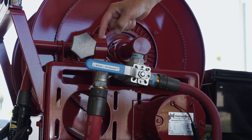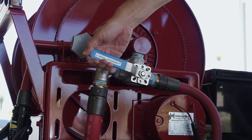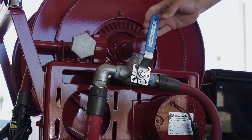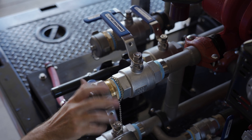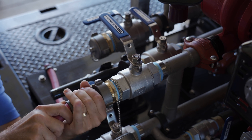In the down position, the valve is situated to discharge water. When using the RPD18, open the valve to the retardant position. Remove the cap from the top inch-and-a-half discharge and thread the supply line from the RPD18 onto the end of the valve and open it.